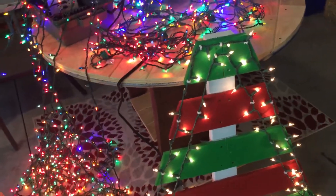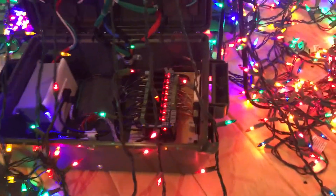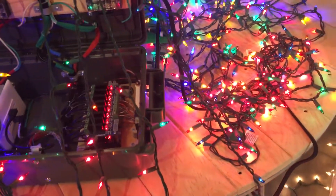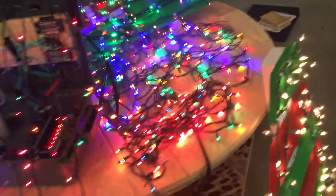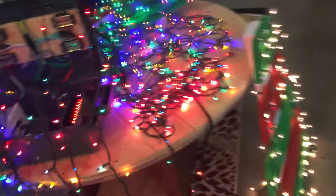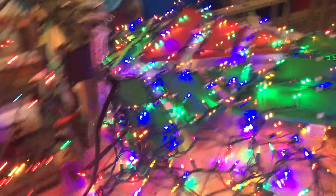I'll put on my website what GPIO pins I used for the second 8-channel relay. These are solid state relays — each one can handle 2 amps, which is 32 amps total, but obviously that's impossible off this setup. We need to make sure all lights plugged in are under 2 amps each. Running off a 20-amp breaker, we want to keep it at 15 or maybe 13 amps and under, which is no big deal because LED lights don't draw much. These other lights draw about half an amp a string.